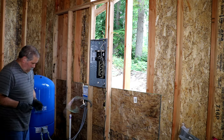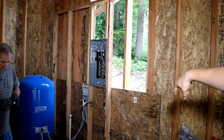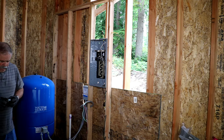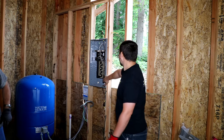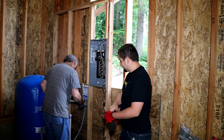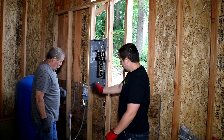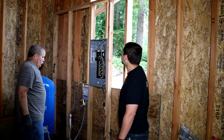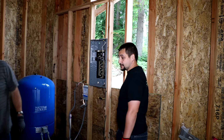As you can see, my dad's working on getting all the wires out of this panel. We're going to get all that out of the way, take down these last couple of 2x4s and this piece of plywood. We've already disconnected the main line after we turned off the main breaker, and this panel will then get put between these two 2x6s once all this other stuff is out of the way. We'll reconnect the well head and one plug-in, and this will be back in business. That way I'll be able to put this last sheet of plywood up and call for the shear wall inspection.